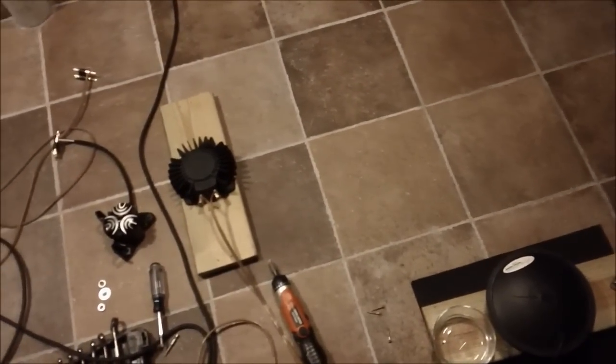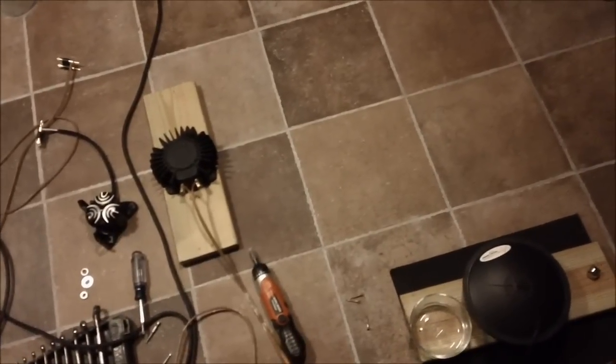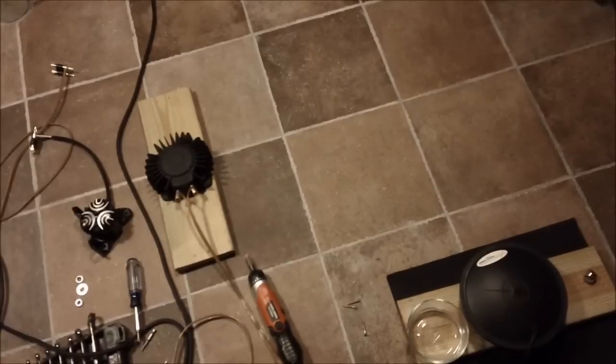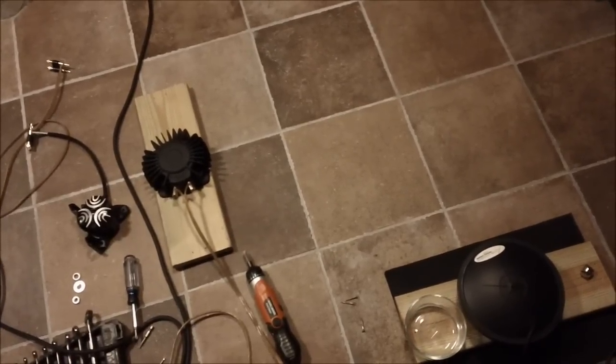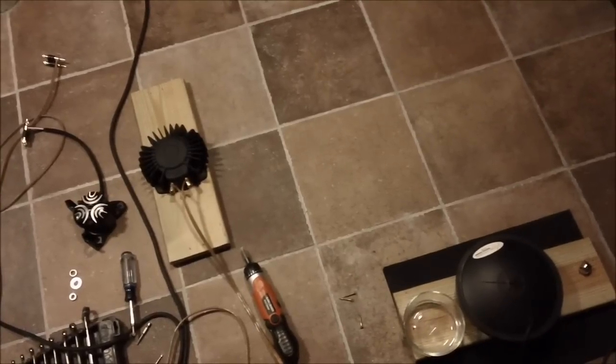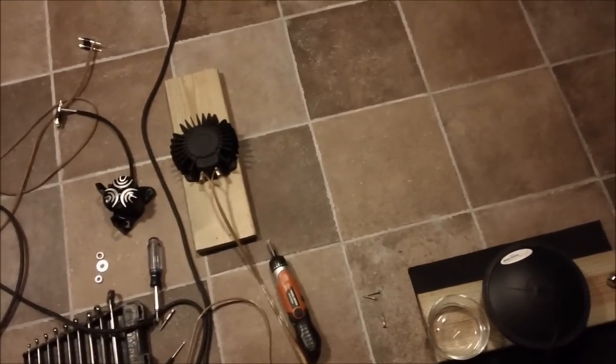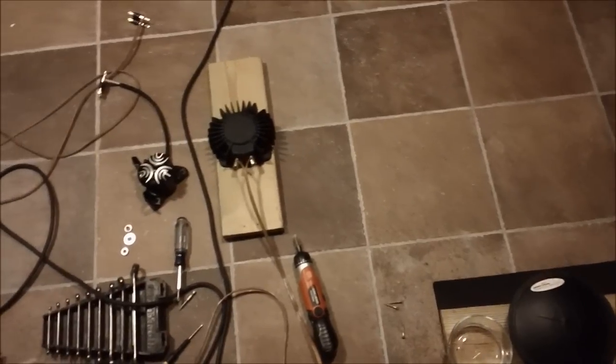So during our actual testing the other night with three other guys, we used the iNuke DSP-3000 on two of these transducers and the Yamaha on the other two. I specifically used the Aura Bass Shaker Pro with the iNuke DSP-3000 because it only has a 50-watt rating and I can limit how much wattage goes to each device through the iNuke. So I limited it to 50 watts so we didn't have any trouble exceeding its wattage limits.